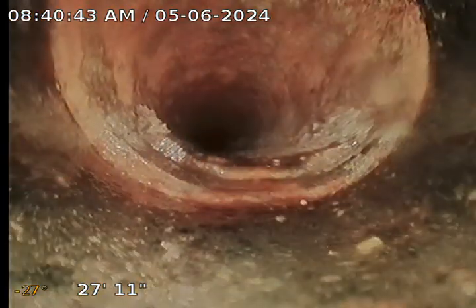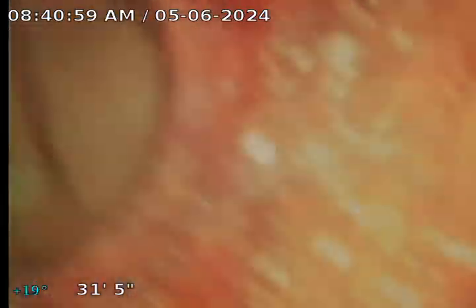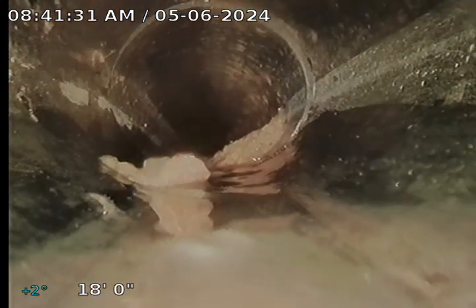So a little section of cast iron and then right back into ABS. Get past some water. It has some pipework done — a little ABS and then back into cast iron. Going as far as I can — that's probably a clean-out right there, just saw the end of the line. Pulling back, just got some old cast iron piping with some ABS joints where they made repairs. There's a little belly going on, not much but expected. Take a picture of that ABS piping.